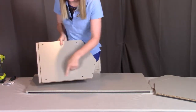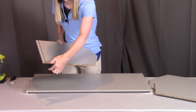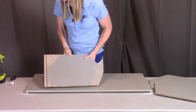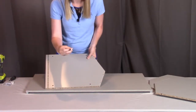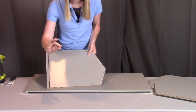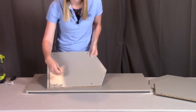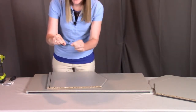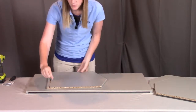We're also going to be putting plastic inserts into these holes. This is so when you screw from the underside, the screws have something to go into to hold them into place. These plastic inserts have a Phillips screw head marking on one side — you want this to be pointing outward so you can see it. That way, if you don't have these holes perfectly lined up, you can use a Phillips screwdriver to turn them and adjust so the screw can go through nicely. You want the hole in the side of the plastic insert to line up with where the hole is going to be for the screw.